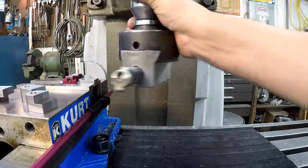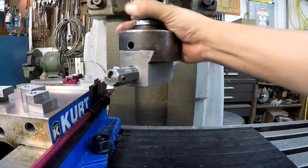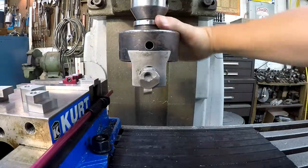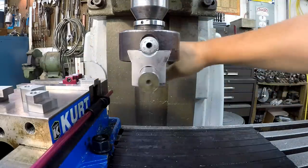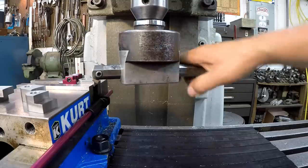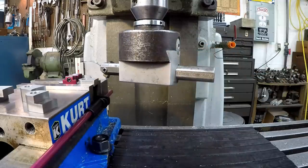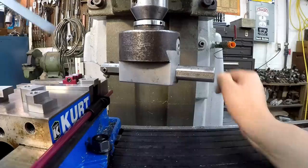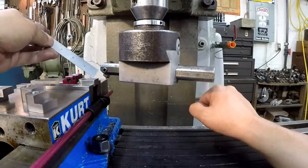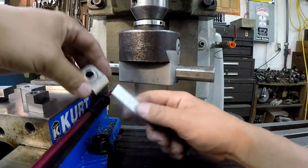And I've been sneaking up on it, and I'm touching all the way around on this top edge right there. All right, I just brought it in, and once it touched off, it cut all the way across there. So I think that's going to be pretty good. We're just going to feed in from right there, and as we're cutting it, I'll measure across the face of that cut and make it about 1/4 inch wide, just to match this block right here.